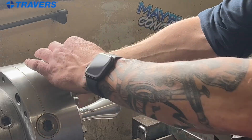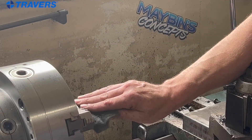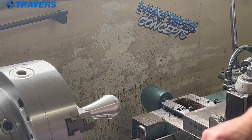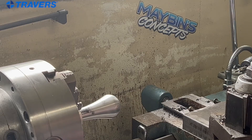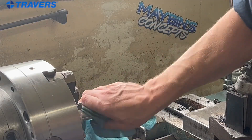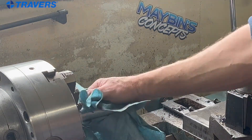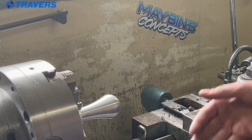I had this machine spinning toward me this way, which is why I had my cloth on the top — that way it will throw it toward me. If I was spinning the machine the other way, then I would need to have it on the bottom because that's when it would throw it toward me. So depending on which way you have your machine spinning, it depends on whether you want it top or bottom. The key factor is it throws your arm or your cloth out toward your body and not in toward the machine.